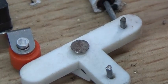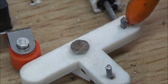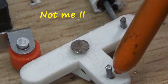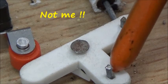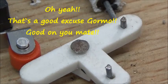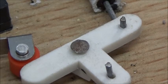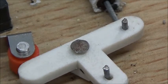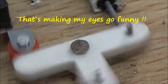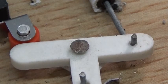This one looks pretty good. They cost practically nothing, so it really doesn't matter. A little bit of movement is not such a bad thing — it helps relieve some of the pressure when it throws. I'll demonstrate it by hand so you can see it throwing the points via the cable. You can also see on the left there a red wheel — that's a micro switch which is activated when the bell crank moves.